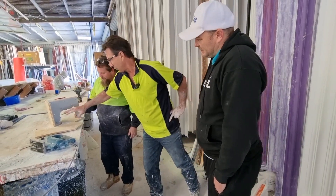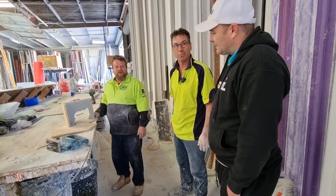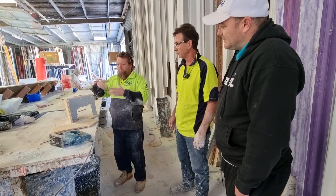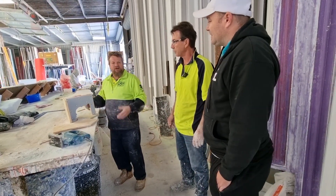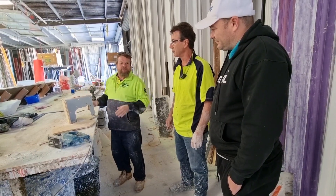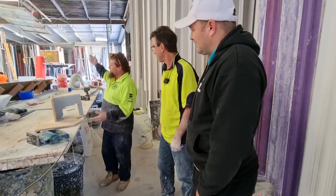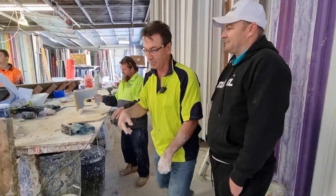This shows here that we're actually carving the plaster out to create our shape. Before we do that, we make another coat that's a bit bigger than that, and then put styrene or old plaster bits to bulk it up before we work it down. Then we just want about a 10 mil face over it, make it all nice and smooth — it actually polishes up with water and comes up like glassy.